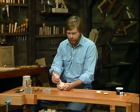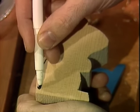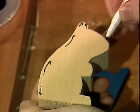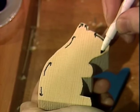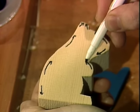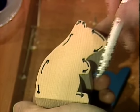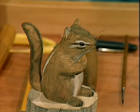When we're carving him, we'll be carving along with the grain this way, down this way, coming up along here. The ears will come up from either side. From his nose, we'll be coming up this direction and then down that direction. For his hands, we'll be working downhill on each side. With his feet, we'll just be going across. As this is end grain here, we'll have to be extra careful, but I'll show you some tricks so it doesn't cause any real problems.